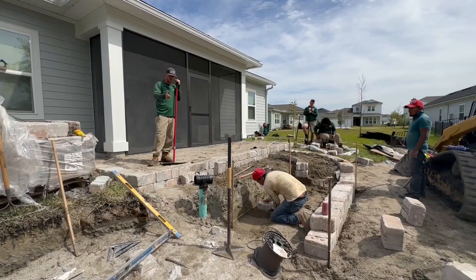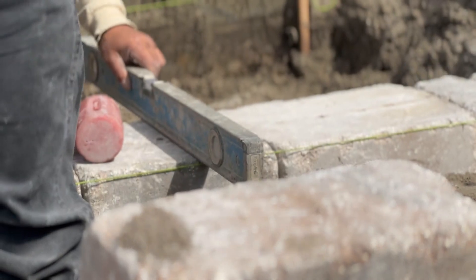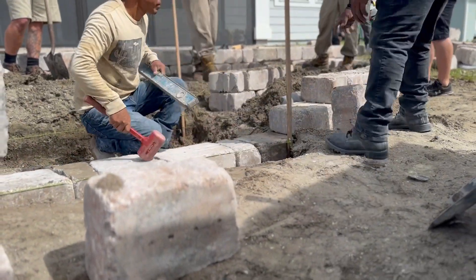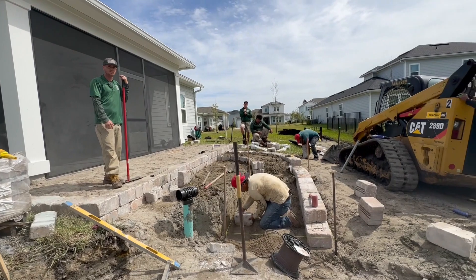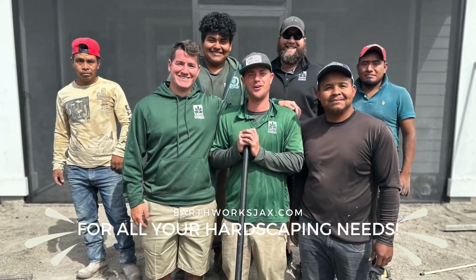The green pipe that you see sitting out right now is a little high — we'll cut that down. That's going to be for our rock and stock. The tee is there, so we'll dig it down so we have the proper pitch for water to flow through, go down underneath the pavers, and out pretty much where Wagner is. So pretty much just get the water from this pinch point and out to the holding area.